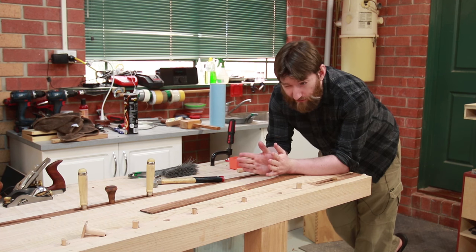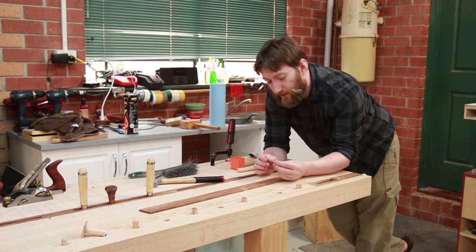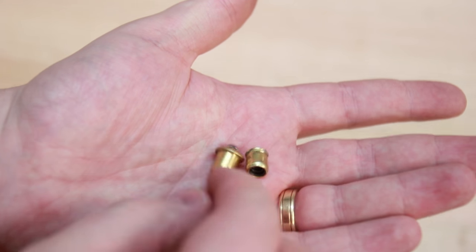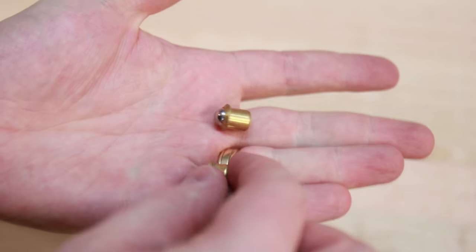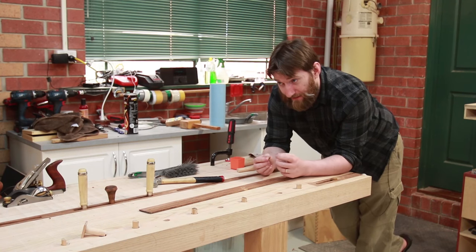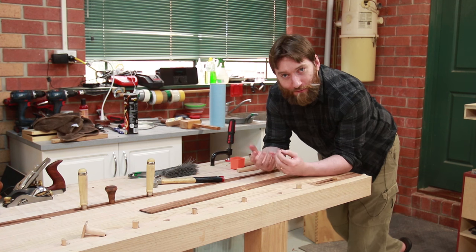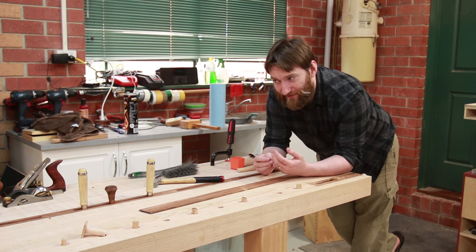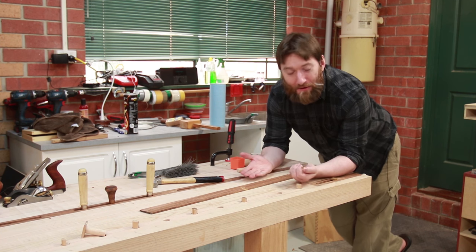I have a dog in every other hole. Ideally I want one in every hole, but the bullet latches I bought aren't as good as ones I've bought in the past — I'm not going to provide links because I'm unhappy with them. These are supposed to have an 8mm stem shaft, but unfortunately they flare out quite a bit at the bottom, so an 8mm hole won't suffice. Go up to the next size and the flange on the front falls through. I'd been hot gluing them in since that's really all they need, but then my hot glue gun died.